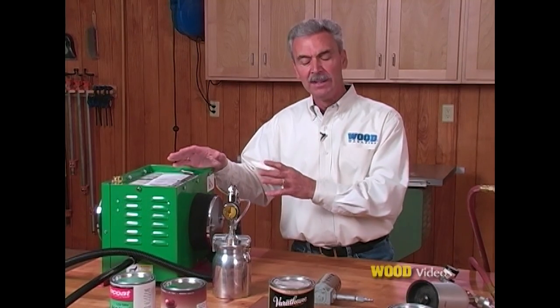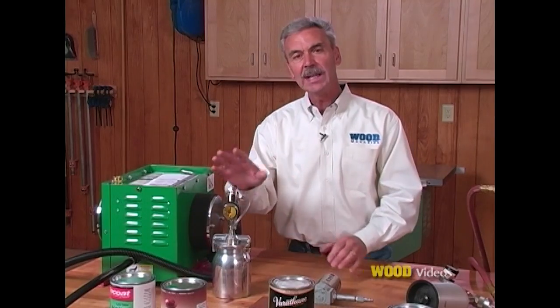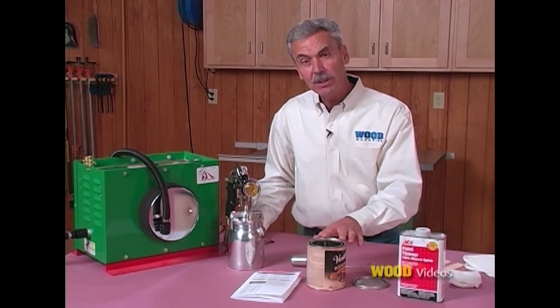The easiest way to show this is to do a real-life situation, and we'll talk about a finish and actually how to get it through a gun. Now, in creating this real-life situation, I've decided to choose polyurethane. You can choose whatever you want. Polyurethane's natural thinner is mineral spirits, so I've got a can of that too. We've got an HVLP sprayer, and we've got our gun. Now, I told you earlier that in HVLP spraying, the only variable is viscosity.